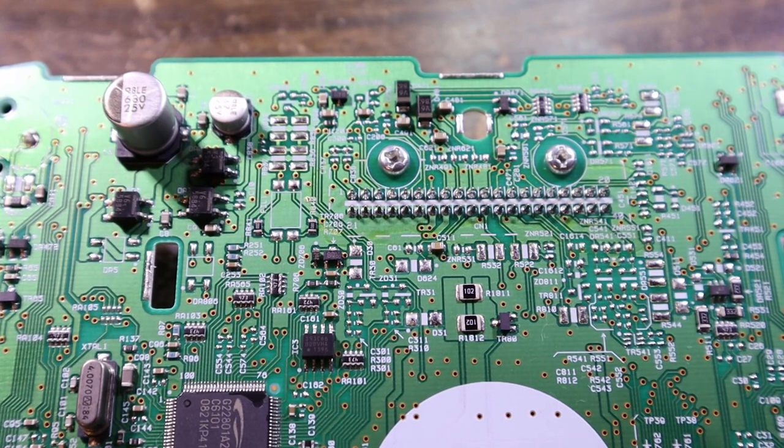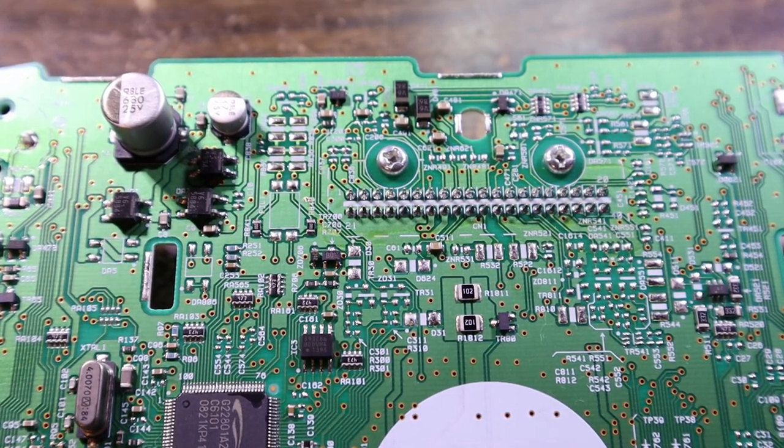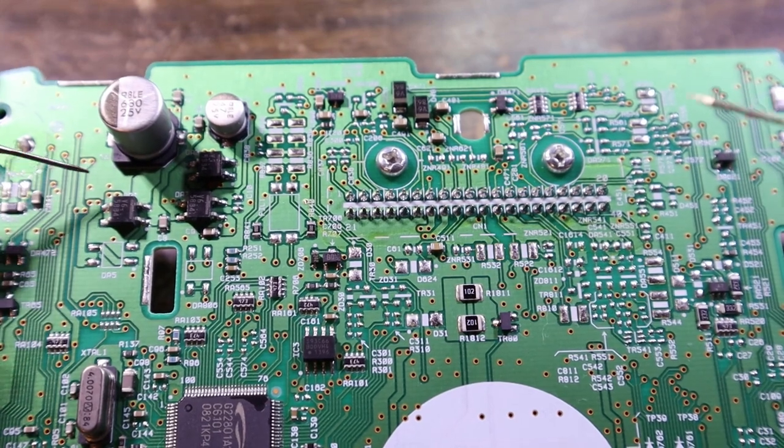And now we have to find our positive feed. So there'll be at least two positive feeds. You've got your always on battery and you've got ignition. And then there'll probably be other signals, perhaps like headlight. So when the headlights come on, then the dash lights come on with it. Might find that this one's on all the time or something funny. Or maybe they come on with a CAN bus signal to tell it that the headlights are on. Anyway, let's start.